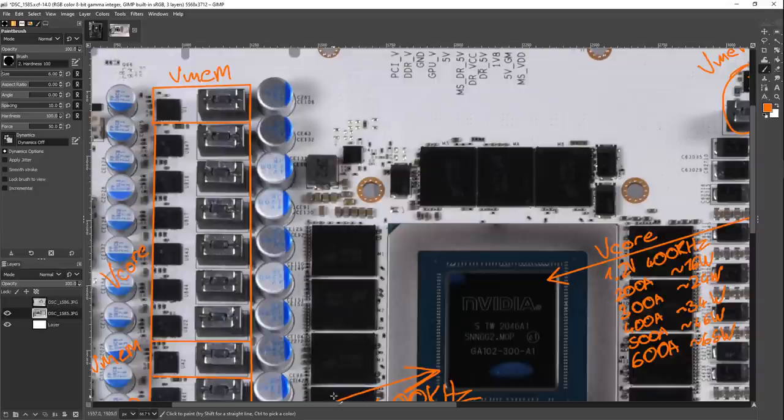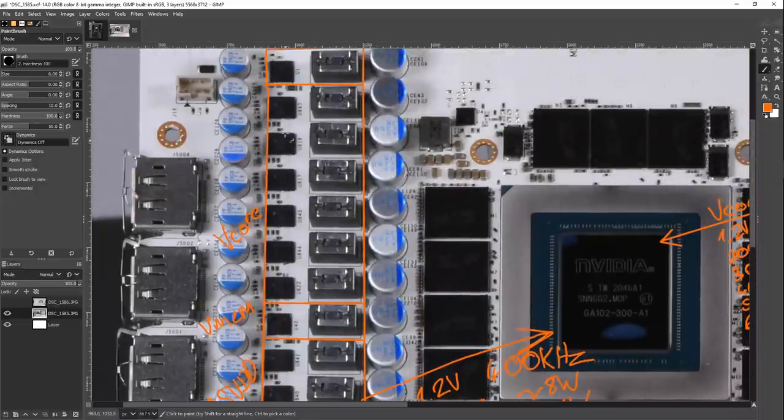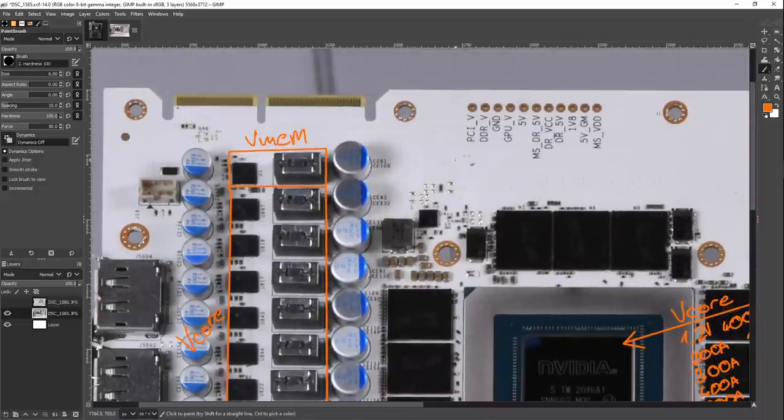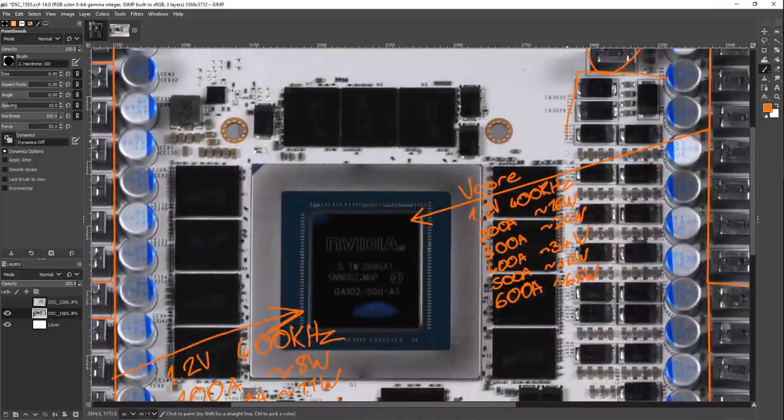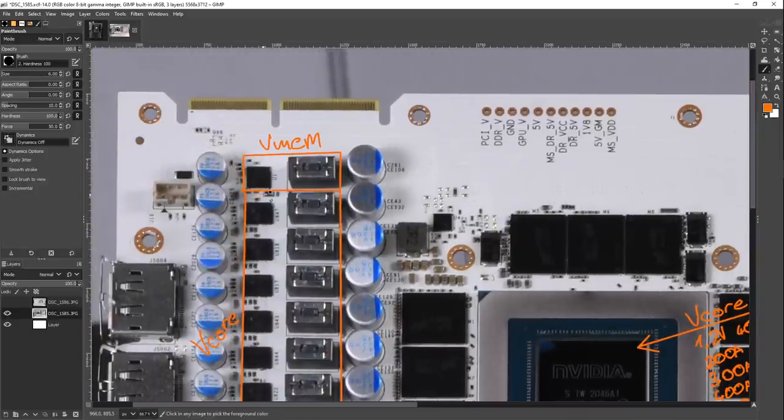I don't have a concrete figure for how much power the GDDR6X memory chips pull. The Hall of Fame card: GALAX decided they're upgrading the MSVDD and upgrading the V-Core to the best V-Core you can find, they've put all this effort into output filtering, and I don't think they're skimping on the memory power. This is definitely cheaper power components than the 70-amp smart power stages, but I assume they did the testing and just came to the conclusion that it makes no freaking difference what power stages you use on the memory VRM.